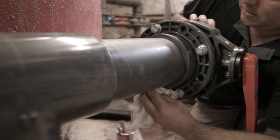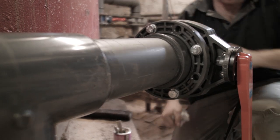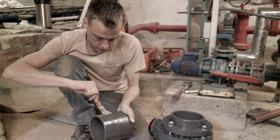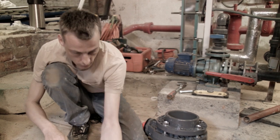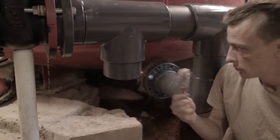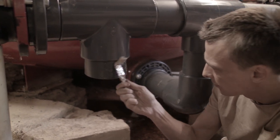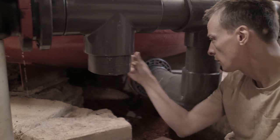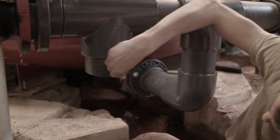It's to do with pressure. Now, if you take it out too fast, the walls can collapse and the tiles can all fall off. And it's the same when you're filling it. You only fill it 18 inches a day. It's to do with temperature, because your walls will probably be very warm, but the water coming in will be freezing. So that's why you've got to take it nice and easy so that everything's not popping, your tiles aren't coming off and all that type of thing. You get people who go, oh, we can empty it in an hour. Well, you're not supposed to.